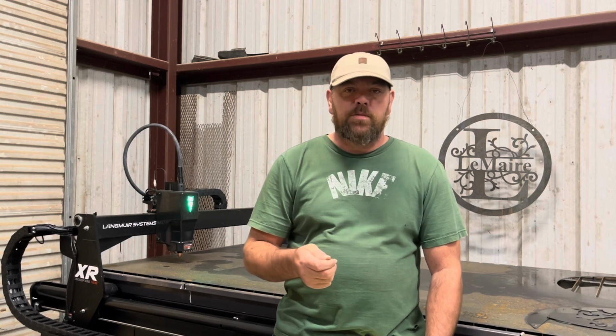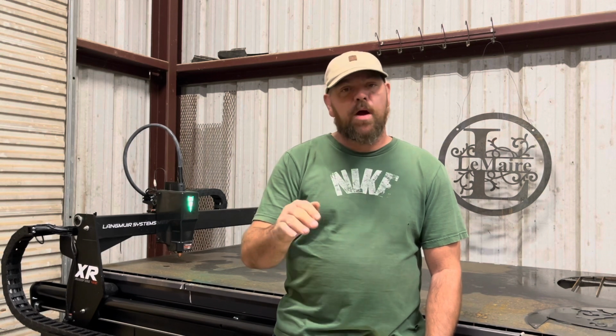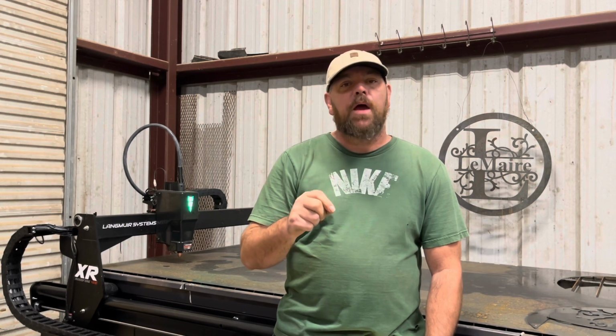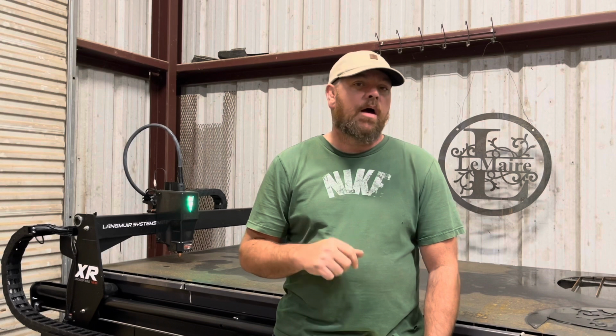I've only used the machine probably 2 or 3 hours altogether, but I would just prefer to have it squared up 100%. I would suggest that you take the bolts, bolt all the pans together, suck the gap out of them, and then line it up. And then send your 11 screws down in the front, then unbolt them and start caulking. I haven't had any problems with leaks.